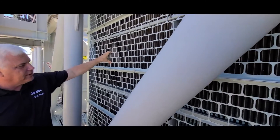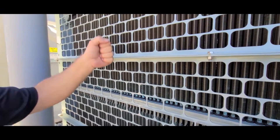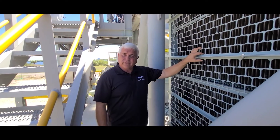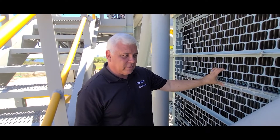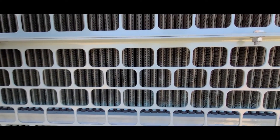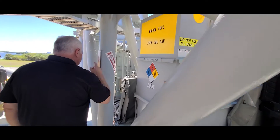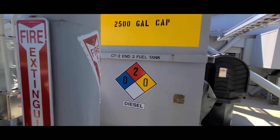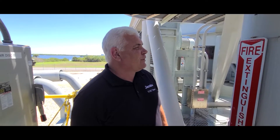One of our guys came up with a pretty innovative design — these radiators. We're actually able to pull them out by hand, so we never have to change the whole assembly out. If anything is damaged, simply push up and pull out. It takes five PSI to keep them in place, and we've had no leaks or issues. We've increased our cooling capacity by over 75%. For our generators, there's always a demand for power, so keeping the engines cool is imperative. We've got the same setup on the other end — 5,000 gallons total. We go by gallons per mile here: 125.7 gallons per mile.